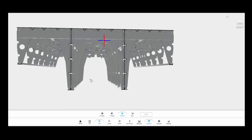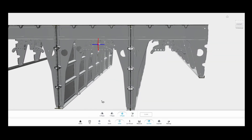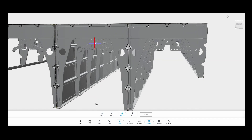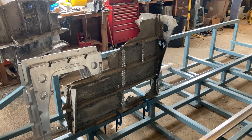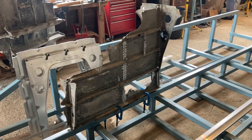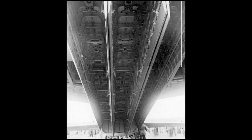The majority of this CAD model was created from measurements taken from the wreckage of BK716. The keen-eyed among you may have noticed that this CAD model is the opposite way up to the picture you've just seen. Here you can see a piece of keel and bomb frame clamped to our jig the opposite way up. That's because when Shorts originally built the bomb bay they built it the opposite way round, and at some point during the assembly process turned it the right way up. As you can see, the picture shows the bomb bay in the orientation that we are building it in.